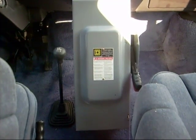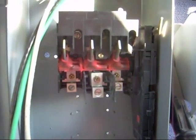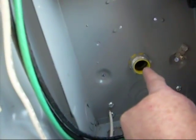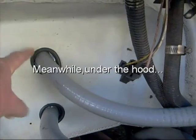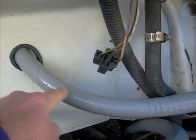The power goes from the variable frequency drive into this disconnect, and from that disconnect it goes on to the motor. Inside there — that's just a disconnect, there are no fuses at all, but it is rated for 600 volts. We are running at 460 volts, so it's well within tolerances. These wires here are from the electric motor. The next thing to do is to push some wires through there down to the variable frequency drive. On the other side of this firewall is the disconnect, and from the disconnect comes this conduit.